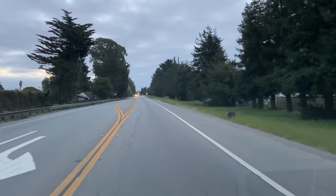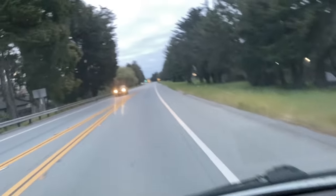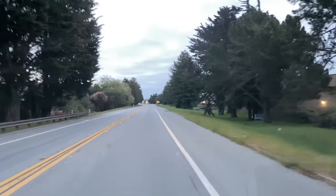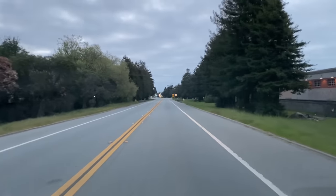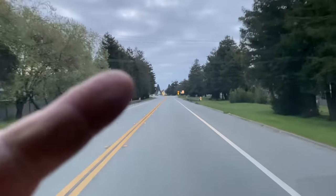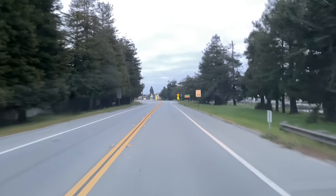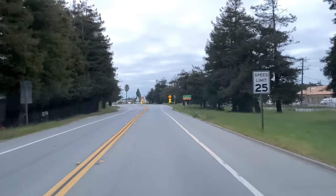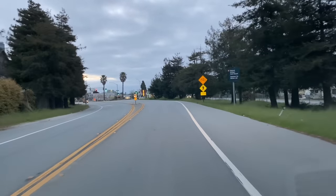All right, YouTubes. We're getting an early start on a Saturday morning. It's like 6:50. We're gonna head out to the brewery. They lost the compressor on their chiller. So we're gonna go change the compressor, both condenser fan motors, the contactor, and see what else. It's an old unit, but they need this thing running immediately.